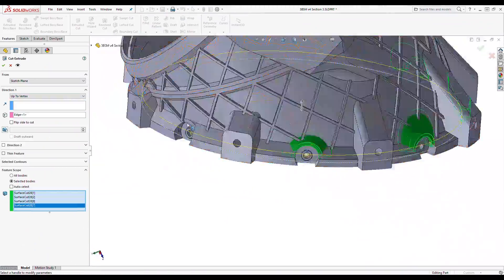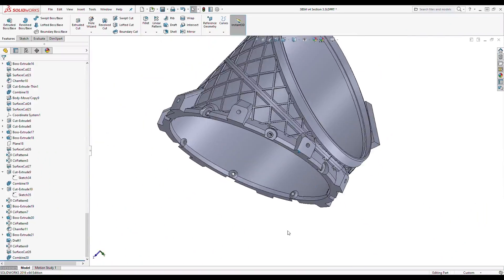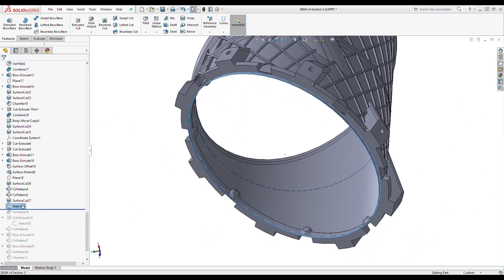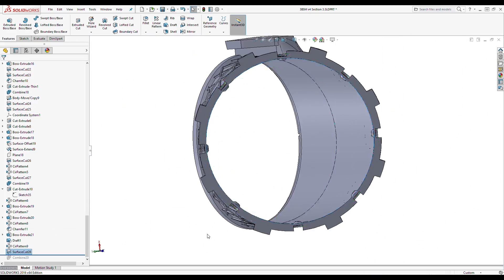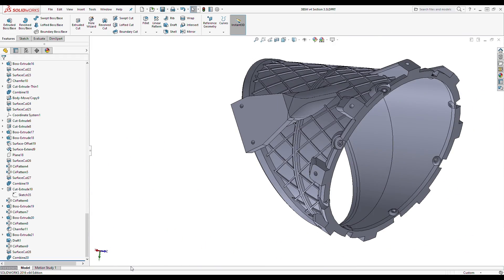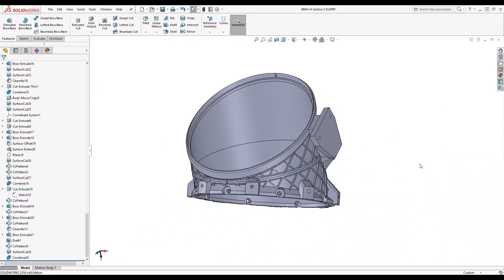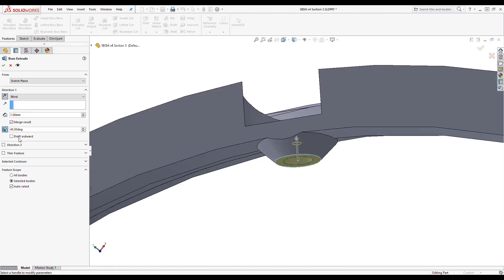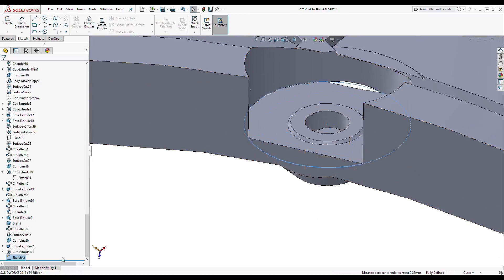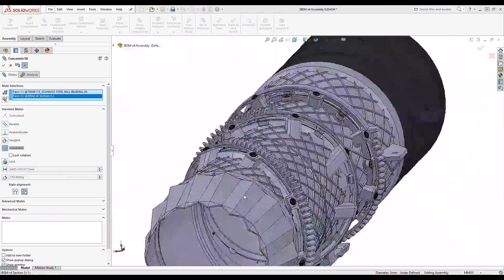The second section, especially where the 45-degree flow direction change happens, was rubbing on the top side of the flanges, and that plastic really has too much friction in that situation for the motors to overcome. So you can see in this SOLIDWORKS clip that I'm adding some pockets for more ball bearings to interact with the face of the flange, so now I'll have ball bearing support on both the inside and the outside of that mate.